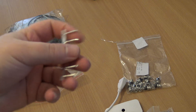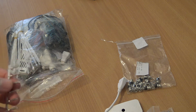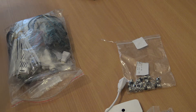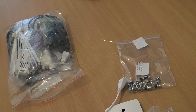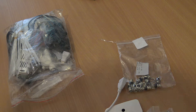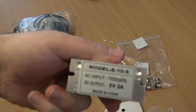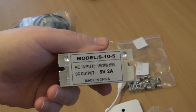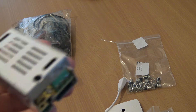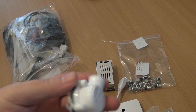I've got some pins, but these are actually the wrong ones — I'm going to have to salvage the opposite type from one of my computers. Although they are the right connector type for a PCIe plug on this power supply, they're the wrong way around. There's also a small power converter that takes AC and turns it into 5V at 2A, which we can use to power the Raspberry Pi from a standard AC signal. I could have used a USB converter but this should be more solid and reliable.